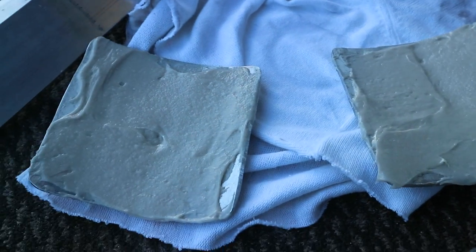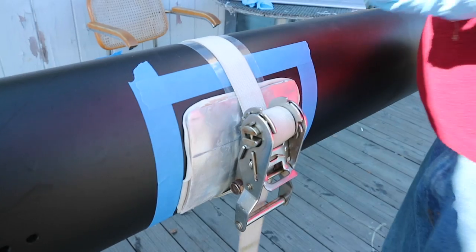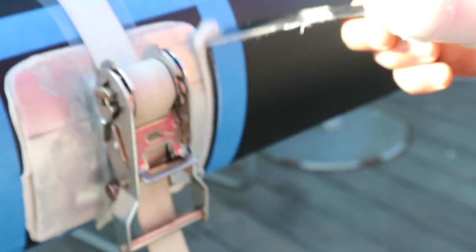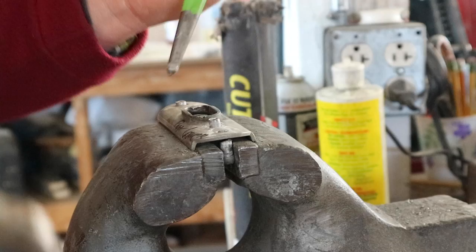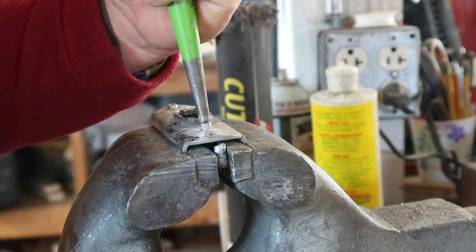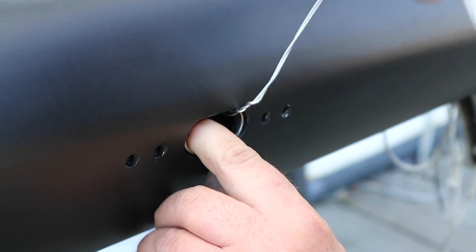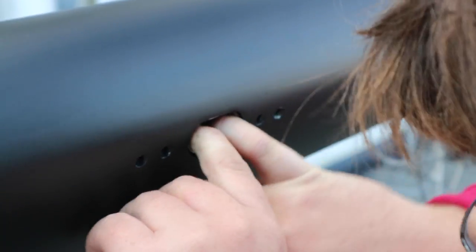We've got our plates. The old spreaders had been wearing away at the sides of the mast, so we had to fill that area in with some epoxy and scrap aluminum plate bent just to the right angle. You might recall that our old backing plates were too small for the new cables going into the mast, so we started replacing them. This would have been very, very hard to do if we were up the mast, eh? Mm-hmm.